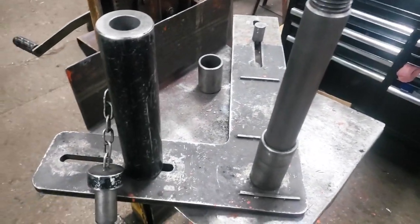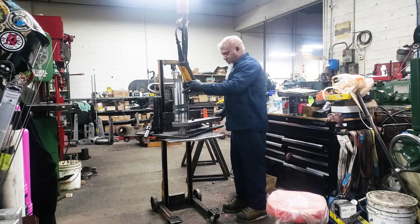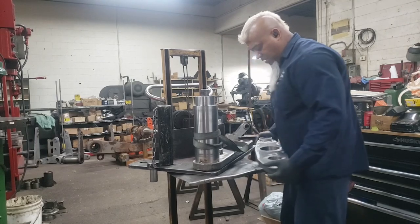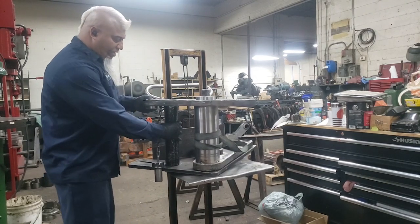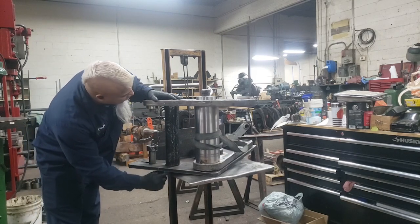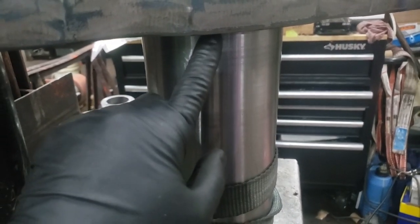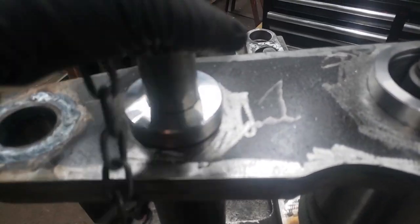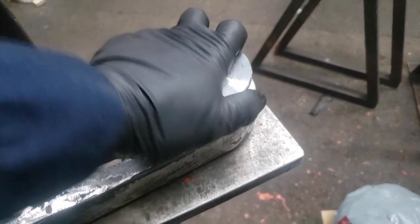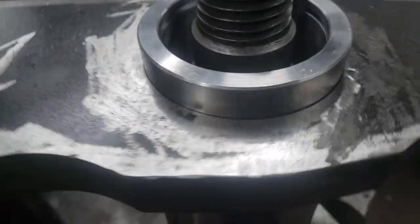So this is the jig that I use. For each idler arm I have to either set the post here or put it here. We're going to put the top plate on now. If you recall earlier in the video, I explained why I didn't weld in that one bushing — this is the reason why, so it could sit flat on that post. If the bushing is welded in it will protrude out the bottom and you will see a gap. Now that I've got this done, I can put the bushing in — it floats to the top, so the gap will be at the top of the bushing. Put the pin in to keep everything in position. This bushing will tighten the movement so you have minimal play in its spot, and I'm going to give it a couple of tacks up here.